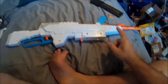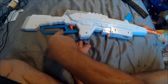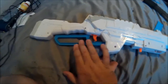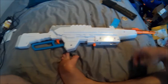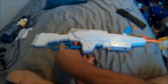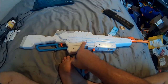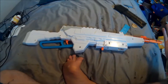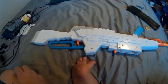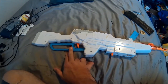What happened was, I was running it, I was getting up in the 210, 220s, and it broke one of these handles. Actually broke the aluminum handle. I know people would probably find that impossible. Well, not at the yields I'm running. When I take this apart, you'll probably see how I broke it. I broke the aluminum handle, and I did not break the U-junction before the handle, which really makes me feel good. The U-junction is obviously really, really strong the way I did it, and I'll explain a little bit how I did it. And I broke the actual priming rod before that.